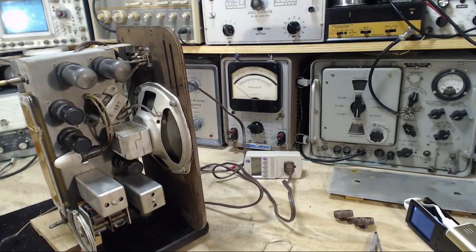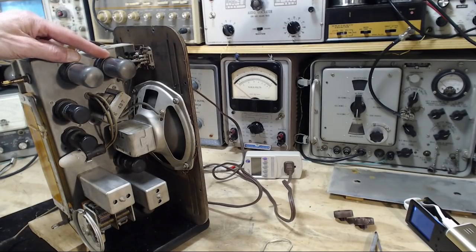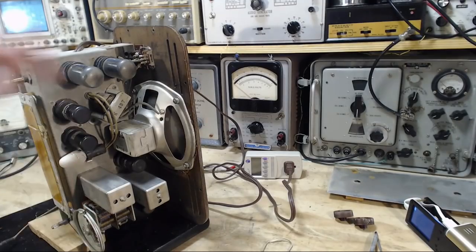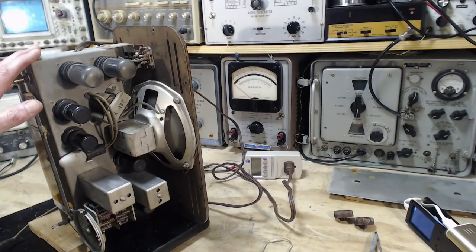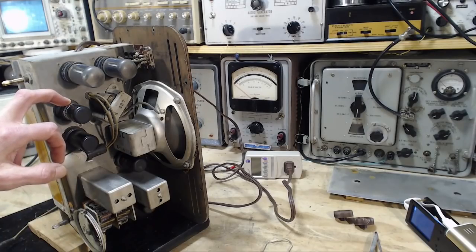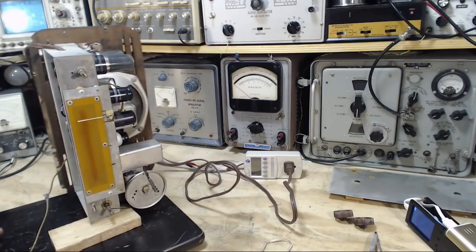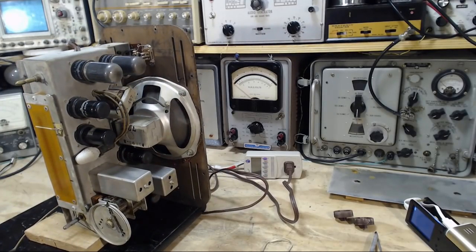So how would this work now? You've got two 35s, so that's 70 volts, and then 10, 20, 30, 40, and 40 and 70 is 110, so it's actually 115, yeah, that adds up. These are all in series, so they must all draw the same current, probably 150 milliamps. So that hum could be from one of these tubes, unfortunately.